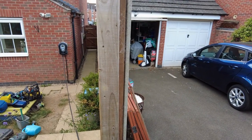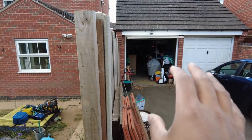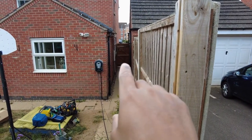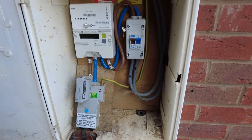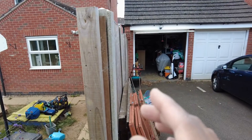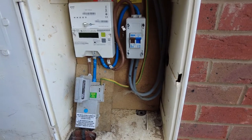This is actually the rear of the property. We've got the garage over there which has a little mini consumer unit or fuse box, and then up in that corner that's where the customer has the electric meter cabinet, and then inside this extension bit they've got the main consumer unit for the whole house. So we had three options: we could either come off that board here, we could come off the meter cabinet, or we could come off the existing fuse box inside of the house.